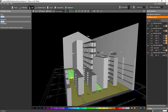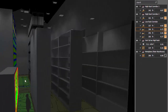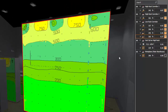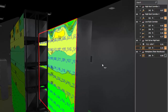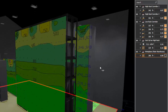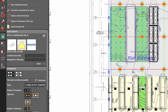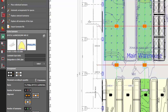Let's calculate. We achieve lux values of 220, 206, and 295, but the uniformity is not good because the higher output is on top — it becomes 305, even 324. For the floor it's 361 and 300, and the overall is 286. Maybe we can reduce the quantity — this area is three by four, so let's make it three by three and compress it a little, then recalculate.